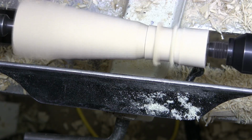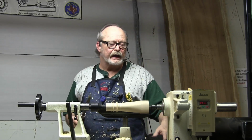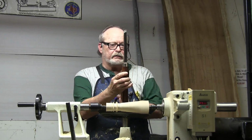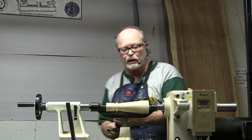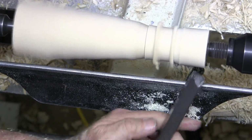We just don't normally lead it into the cut. The trouble is the trailing part of the tool, never the leading part. That's true of bowl gouges and detail gouges. It's what's coming from behind. So here's the physics. Draw a line right through the middle of the tool, its axis.